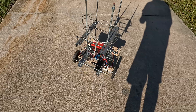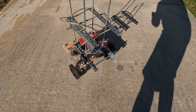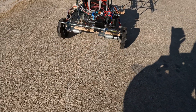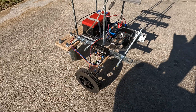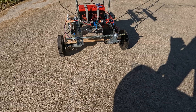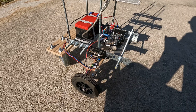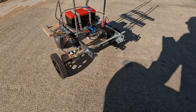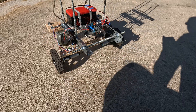There it goes. I also have the duty cycle at 70–75 percent — 30 percent did not have any result; I believe my robot is a little too heavy for 30 percent. As I mount more components and the robot gets heavier, when I run two motors I'll have to go up on the duty cycle percentage. Thank you for watching.